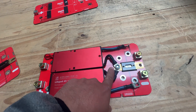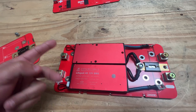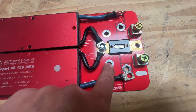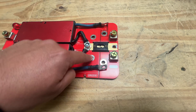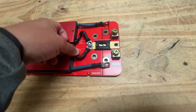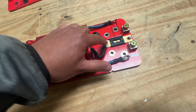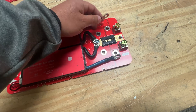To keep it symmetrical, we have to make one of these BMSs be flipped upside down — that's what we're doing here. Now it's symmetrical. The cable can connect here. I added these two extra holes just in case the angles were going to be too sharp. You could connect the wires in there and they look better with less of a sharp turn, but then it requires extra hardware — three bolts instead of just one. So you can build it either way, and we'll probably keep those holes on the production versions.